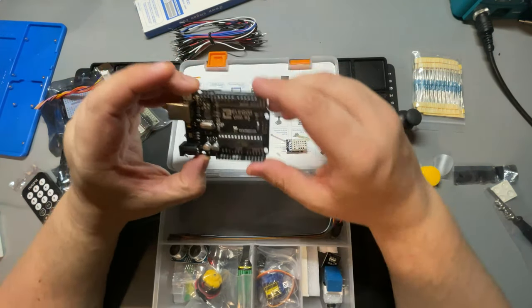Add the libraries and open the serial monitor. So that I haven't done yet, actually. I haven't actually connected it to the computer yet. I thought we'd do that together. So what we'll do is we will connect up the Uno to my computer and see what happens. Just connected the Uno to my computer. And you can see I'm in Device Manager and in Ports. We've got COM port 3 is assigned to the Arduino, which is fantastic.